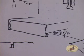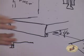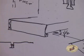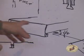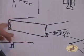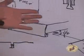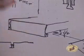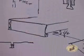In the late 19th century, plywood came along, and plywood, because the layers turn at 90 degrees from each other, really doesn't expand and contract very much. It stays about the same all the time. And so you could go to a drawer in which the back was the same dimension as the front. You essentially built a box, and you simply trapped a piece of plywood in for the bottom in a groove when you assemble the drawer. That's the way kitchen drawers, most drawers are built today.